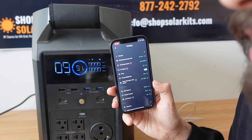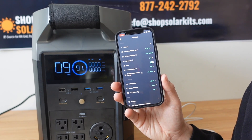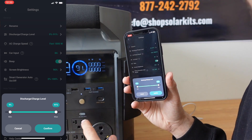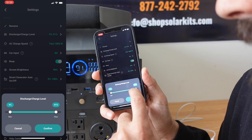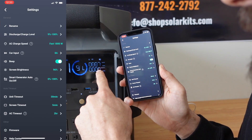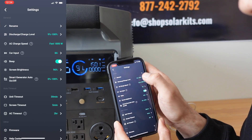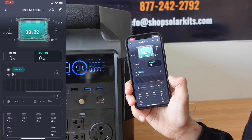If you come up to the top, this is where you can change various settings in your EcoFlow Delta Pro. If you hit discharge and charge level, you can set the percentage of charge you want your Delta Pro to operate within. I've set it so the Delta Pro won't get less than 9% battery and won't charge more than 91%. The Delta Pro is plugged directly into the wall right now, and because I've marked it at 91%, it won't charge anymore. Let's go into the app and change it to 100 — hit confirm — and watch instantly how this starts to charge. You can see it's already shooting up, and back on the main settings tab we can see the input going to 1,500 watts. If I change it back to 92 and hit confirm, as soon as the unit hits 92% it stops charging.